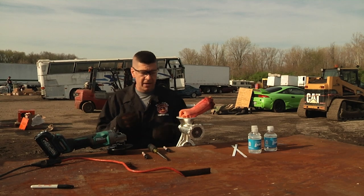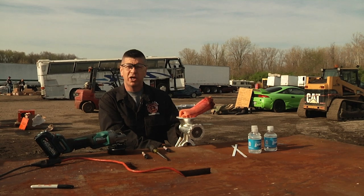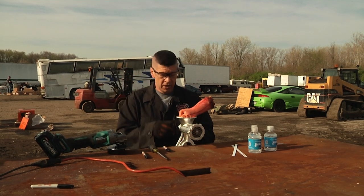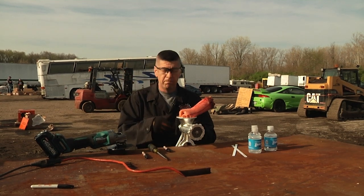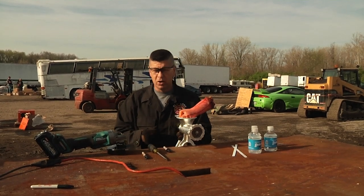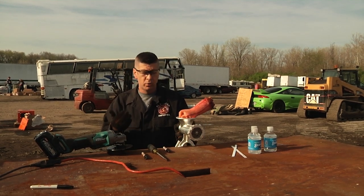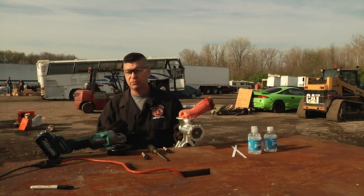Then we have to start thinking about what's powering this machine. For training purposes we use this hand-operated grinder — not very practical in a real scenario. However, a real machine could have a small motor and a belt that powers it. We can either unplug it or cut the belt. If you go to a local butcher shop, unplug it from the wall. It could have a dedicated breaker, but we have to make sure that we lock out and tag out that machine.